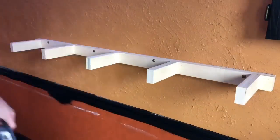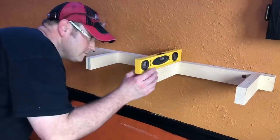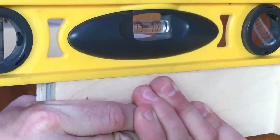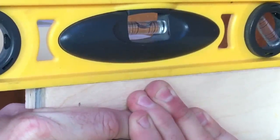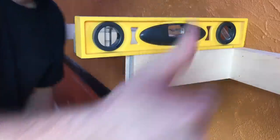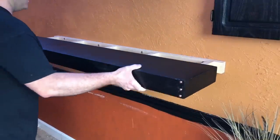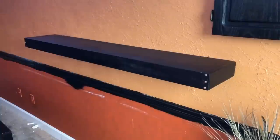You install these with five-and-a-half-inch lag screws in the top portion of the bracket. What that does is put upward pressure on the shelf — just one or two degrees upward. When you install the shelf and put weight on it, it stays level for its entire life and will not sag below 90 degrees. And just like that, you slide the shelves on — looking mighty nice.